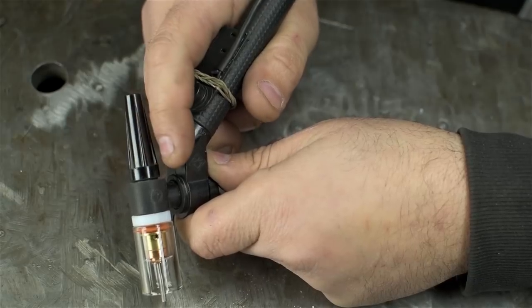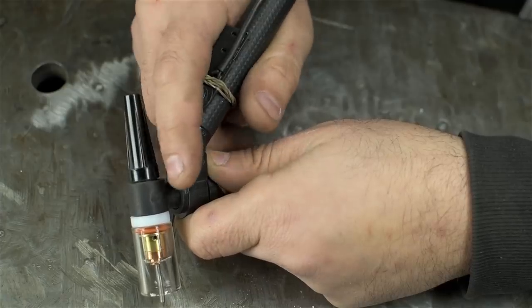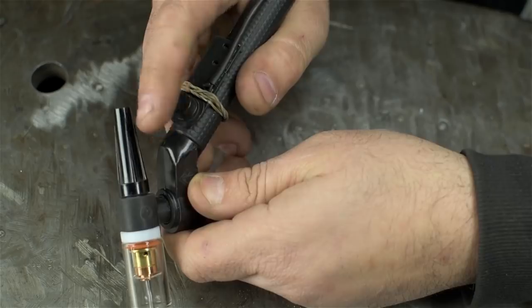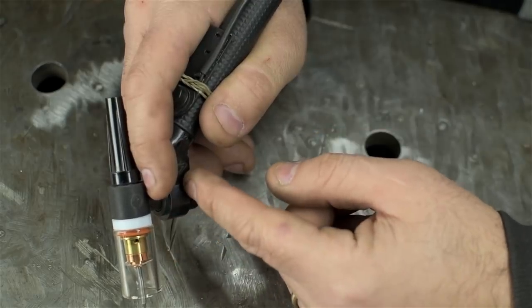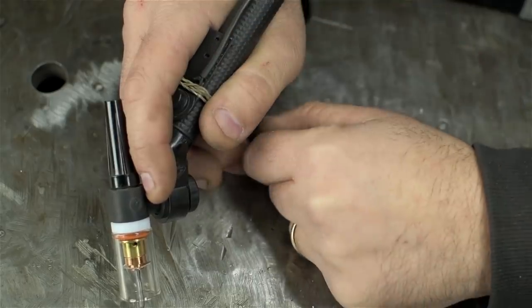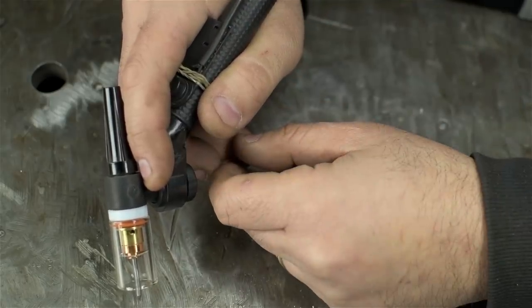Sorry, I had to get this turned around in my other hand. I was saying I've taken to using it sort of in the crook of my finger in my grip somewhere, instead of like an actual button. This lets me keep a good solid grip on the torch, but I can still exert pressure on the button to ramp or drop off the amps. Squeezing the button this way doesn't seem to compromise my control.